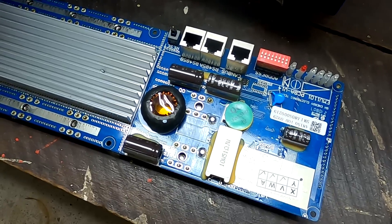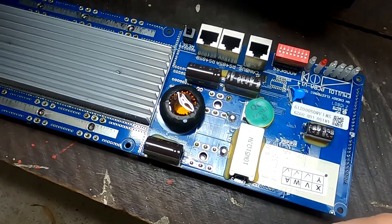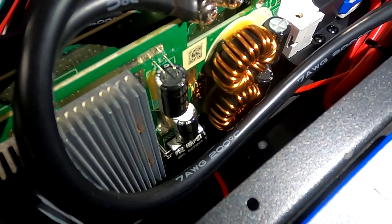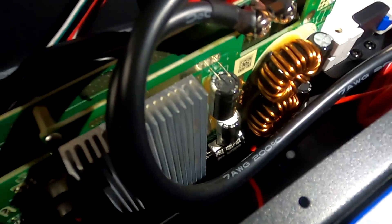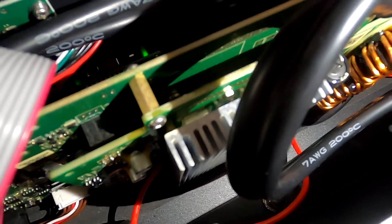Because the Seplus BMS limits current to 10 amps, there's only one inductor and two or three capacitors. Here in the Pace BMS we have two inductors and a lot more capacitors on this current limiting board. You can also see this heatsink with the MOSFETs underneath which are switching the power on and off, really like a PWM controller. So this limiter in the Pace BMS is a bit beefier than in the Seplus BMS, because the Pace BMS does a 20 amp charging limit.